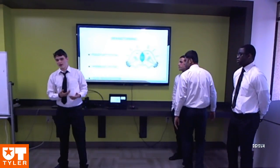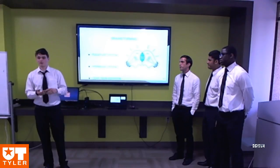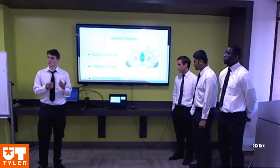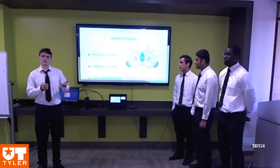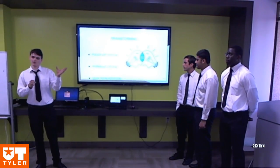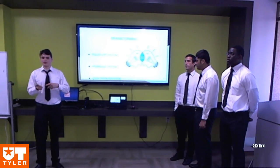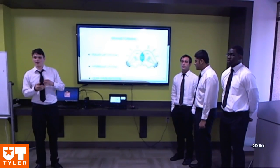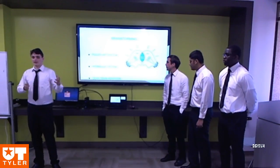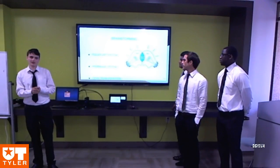Once we had our design goals in mind for our project, we began brainstorming potential solutions to our problem. First, we came up with a pulley and metal cable solution that would allow the user maximum adjustability. However, once a torque was applied to this suspended load, it could result in slack in the cables, which would be a risk to the user. Secondly, we came up with both horizontally and vertically mounted hydraulics to position the lift, but this resulted in difficulties with the suspended hydraulic using its force. Finally, we came up with a gear train rotation, where the gears would reduce the torque necessary to rotate the load so the user could crank and rotate the bike about its axis.